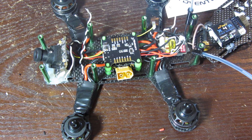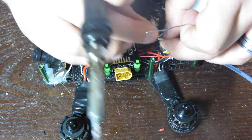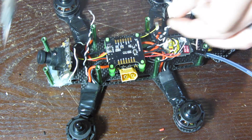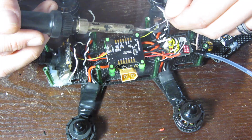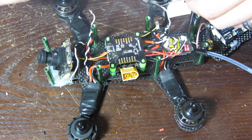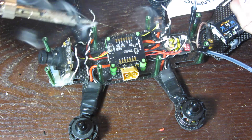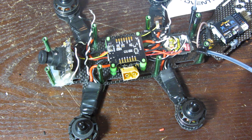I've got my digital soldering iron heated and set at 700 degrees. We're going to see if that's enough — I think it should be. I typically do that with all of my smaller wiring sets and PDBs. Notice that my soldering iron only touches the wire for about one second before it starts sucking in the solder to tin it. If your soldering iron has to stay on the wire longer than that, stop and check your temperature.